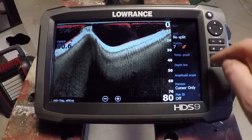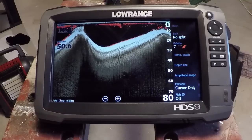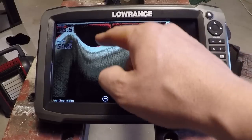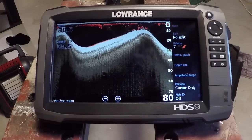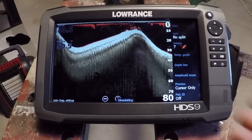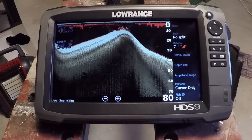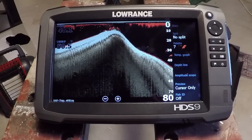When you play around with the color palettes a bit, that can help. This feature wasn't really all that popular — not a lot of people used it. What it really allows you to do is take your downscan imaging, which gives high-detail bottom structure, and still mark fish, because the down imaging did not do the greatest job of marking fish. This particular recording is done with an LSS1 and an HST-WSBL transducer, so it's not going to be the greatest quality you could see today with something like a total scan transducer, but it'll give you an idea of the feature.